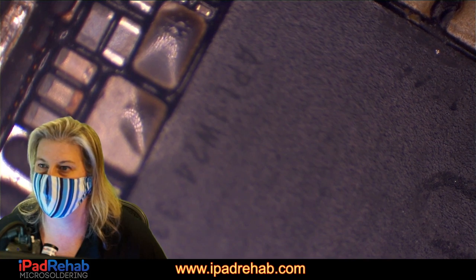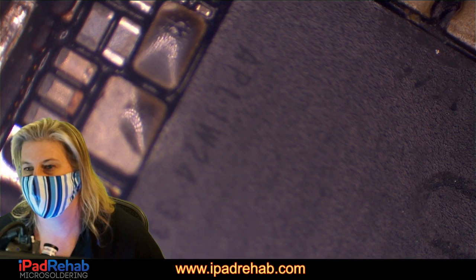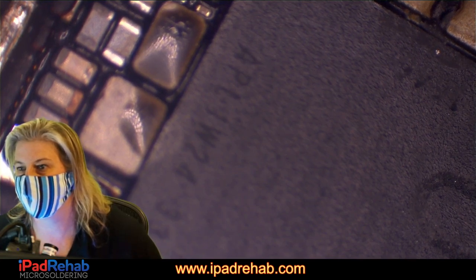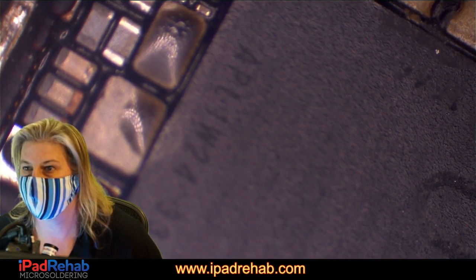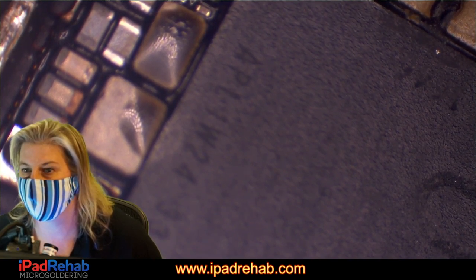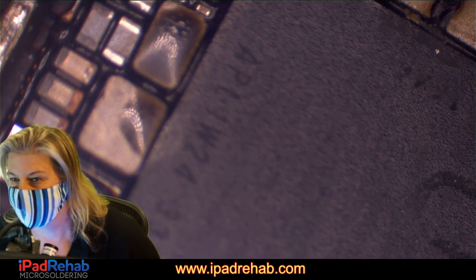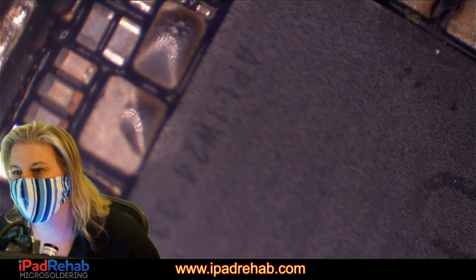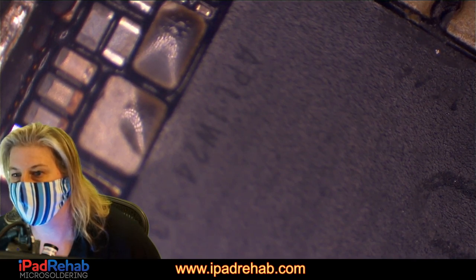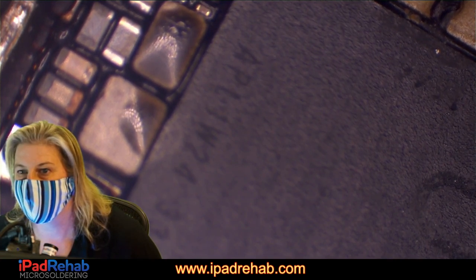It's unlikely to be a short on this line because that would not generate a ton of heat, because it's not going to see any electricity from main. Plus, that's only going to go to the CPU. That doesn't really have a mechanism for failure. So what else? The next door neighbor, button power key. I don't think that's going to be our guy, but why not?